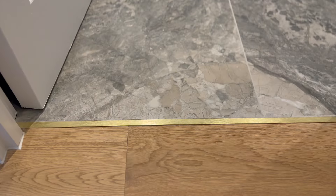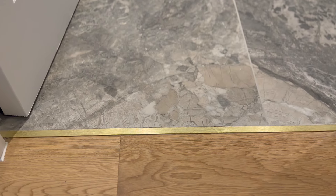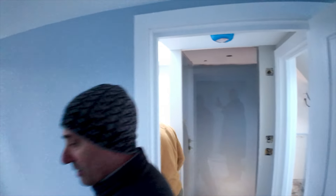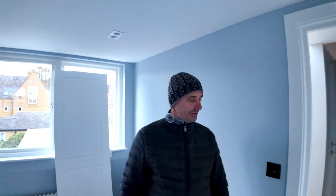How do you get this floor to actually meet the wood floor with the tile? Well, you need to calculate everything — keep in mind how many millimetres you build up in the bedroom and how many millimetres you build up on the bathroom floor. Then you do the calculation in such a way that the junction connection works. Not many contractors will do that.